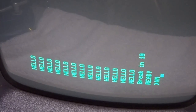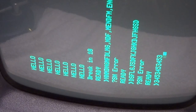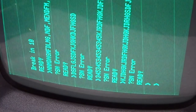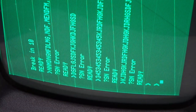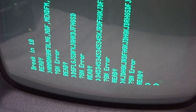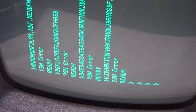The CRT is looking quite good. The sharpness is way better than any of the older TRS-80s. Brightness is not particularly great and the contrast is turned all the way up. If we turn the brightness up we get a raster — we're just not getting a lot of differentiation between black and white. But it's working, bright enough to use, looks very clear, and there are no funny noises coming out of the computer.